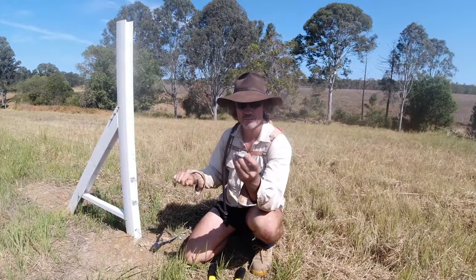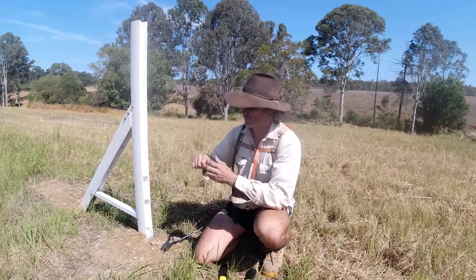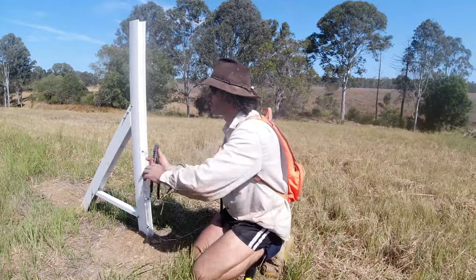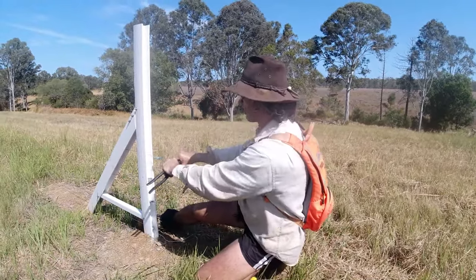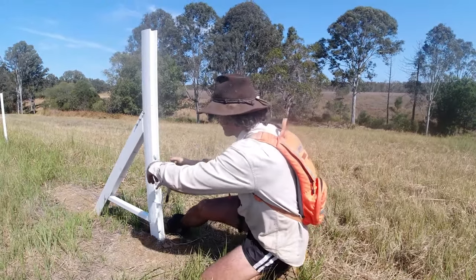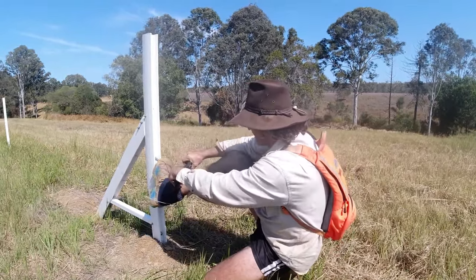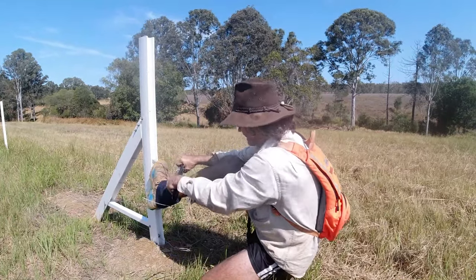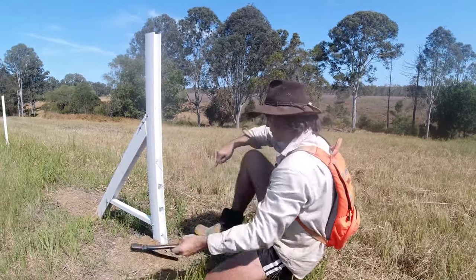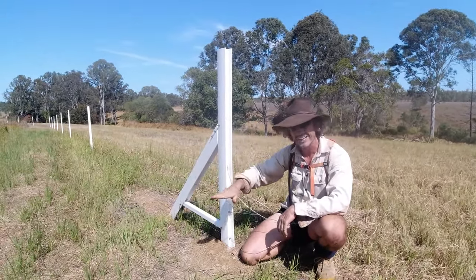I like to use gripples - that's a medium-sized gripple. What I like about the gripple is you can just slide it on where you want it, it locks in there, and all I do then is just use my set of fencing pliers to just pull that back and keep sliding the gripple down. I put my foot there, hold that gripple, and once you pull that back the gripple stays in place. Pull the tension on it - you only need it hand-tight. That's all it is, hand-tight all the way along.